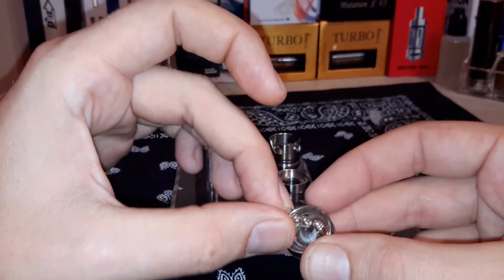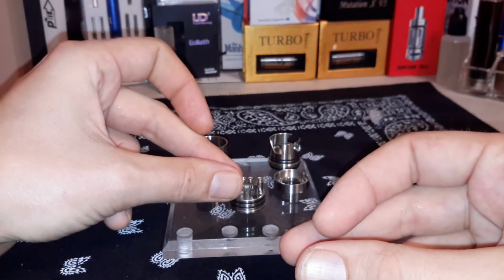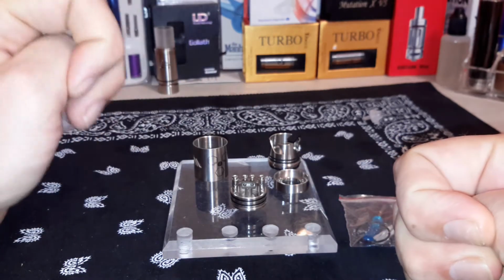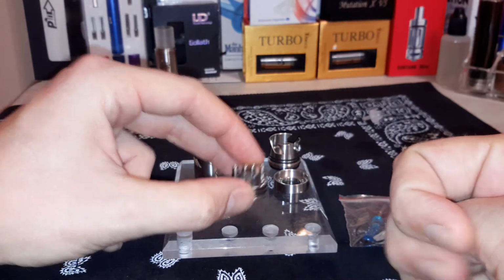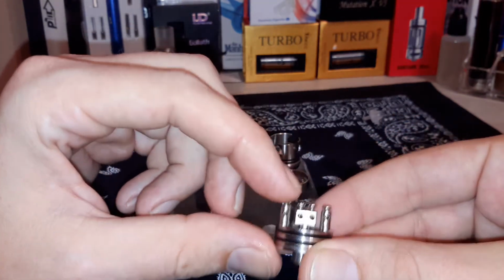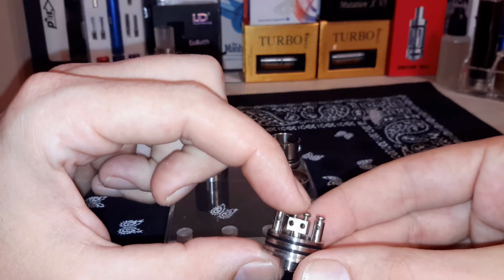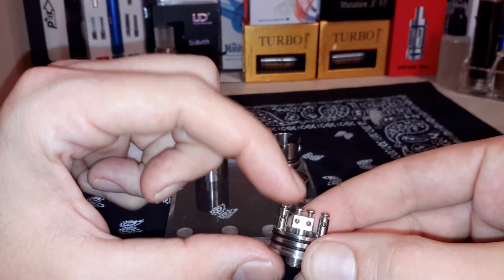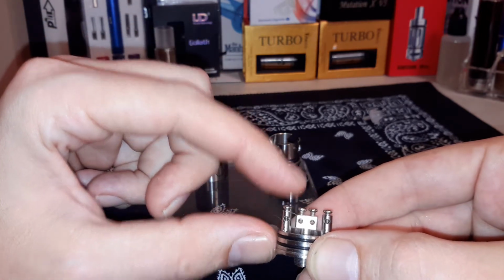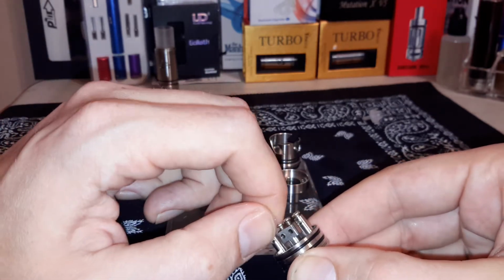I actually made this video already once, about a week ago, and I am just remaking it now. So when I first got this guy, it was not usable in the sense that I like to build with 26 gauge wire. The way that they had machined this post, it was too tall, and the screws were too short. So the screws would bottom out a little bit too early, and it would not allow a good contact between a 26 gauge or smaller wire.